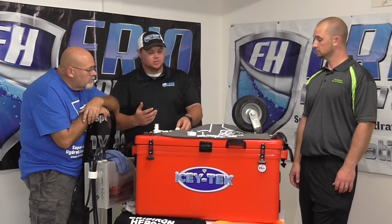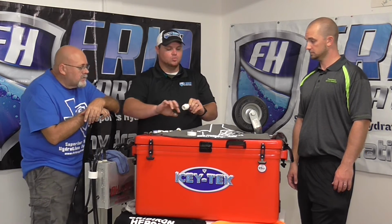And all you do with this right here, it's going to come out. It's a little messier than Teflon tape, I'll tell you that. But you're going to get a good coat in your threads, and then once you run this fitting wherever you're going with it, it's going to seal up. Same concept as Teflon tape. We're taking all the small little spaces that could be there and cause leaks out.